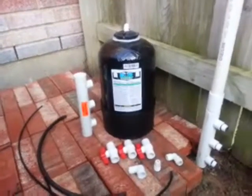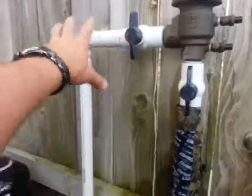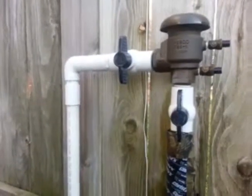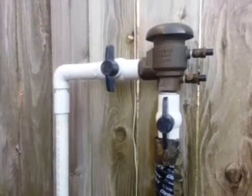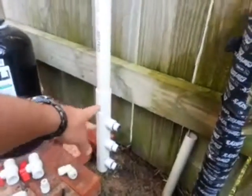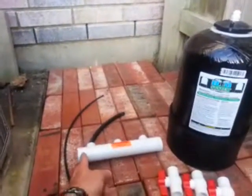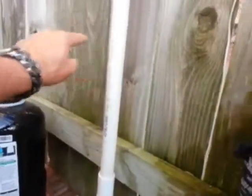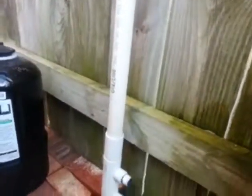All that comes with it. Essentially what you're going to do is install the manifold into your backflow device. I've taken the insulation off of this — it's a PVB backflow device, one of the two devices we recommend for use with our system. An RP or reduced pressure type backflow device is also acceptable in addition to the PVB. I've already installed a manifold on this unit — basically all that was involved was measuring the length of the manifold minus the insertion length on each end, which is approximately one inch. Then you cut that amount out of your PVC and simply glue that into place.